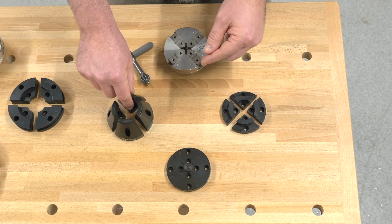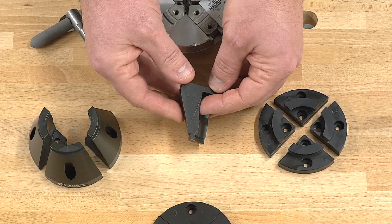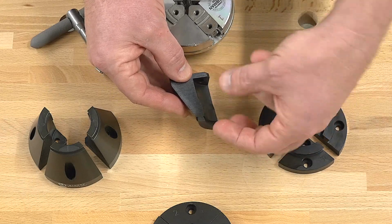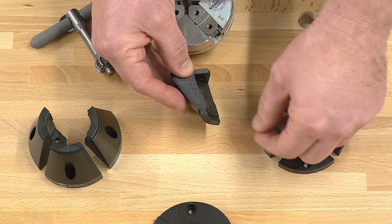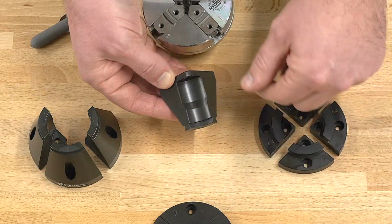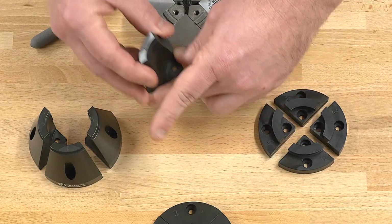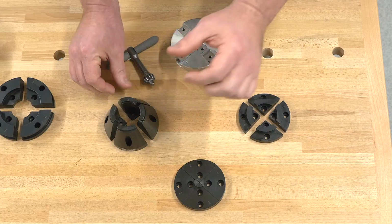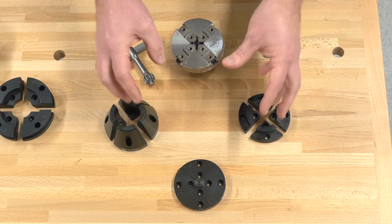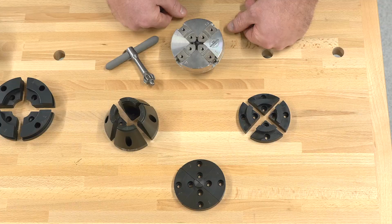And then we come to a very well-established jaw. This is an O'Donnell jaw, and with the O'Donnell jaw, very, very deep in the jaw itself. So if you want to throw your workpiece away from the chuck a little bit further, we have the 2 surfaces which are dovetailed here on the top. But also we have a nice parallel shank on this side here. So if you want to hold long-stemmed goblets or cylinders of any sort, that's going to be the jaw for you. So a nice little bundle there of jaws and the 80mm chuck for the smaller machine.